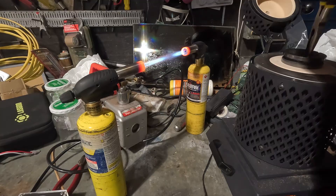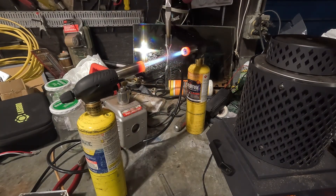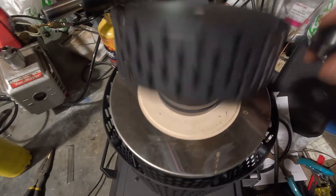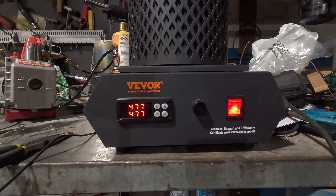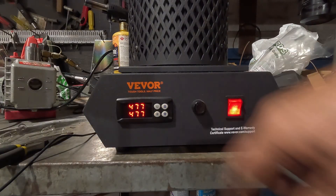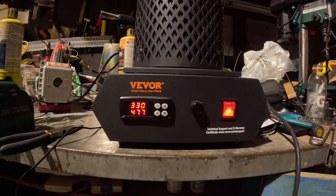Another lesson I had to learn the hard way is the glass ampules kept on breaking. As you can see here, with this glass ampule between two polarized pieces of film, you can see the stress crack. In order to get rid of those internal stress fractures, I'm going to attempt to anneal the glass, which is bringing it up to about 477 degrees Celsius, then slowly bringing the temperature down, as opposed to shock cooling it by leaving it out in the air.